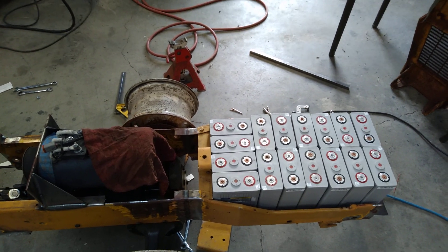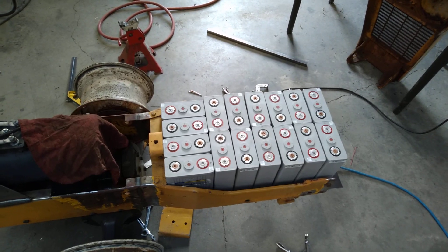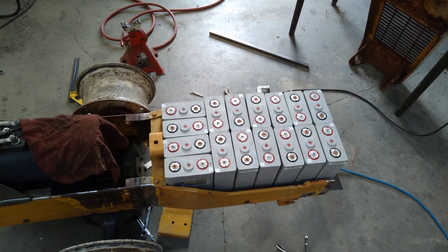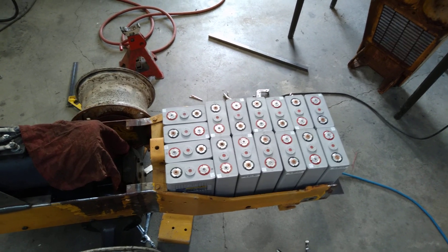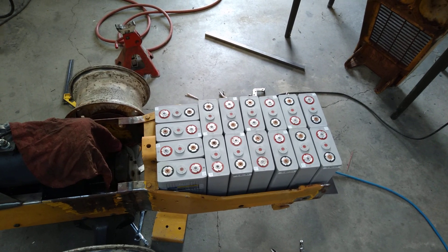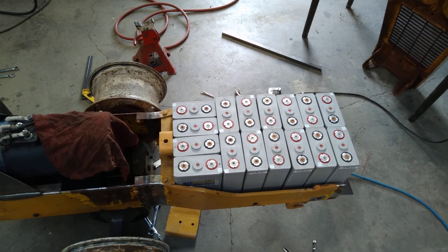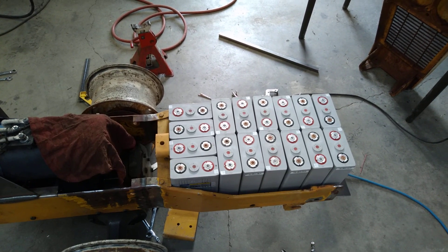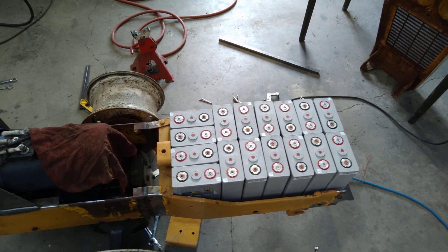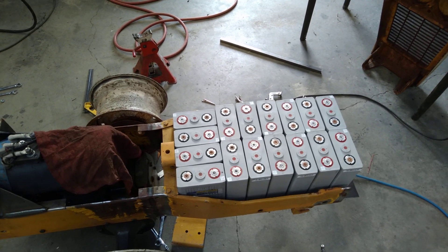With lithium iron cells, you can safely fully discharge them — from fully charged to 0% state of charge — and you can do that over and over again for, some of them, as high as 7,000 charge cycles. At the end of those 7,000 charge cycles, they claim 80% capacity — 80% of original capacity. So if these are 100 amp-hour cells, you'll have 80 amp hours, and you can do the math to figure out what your degradation has been.